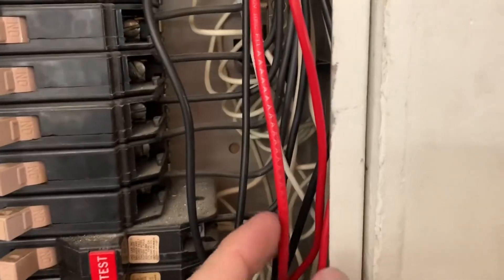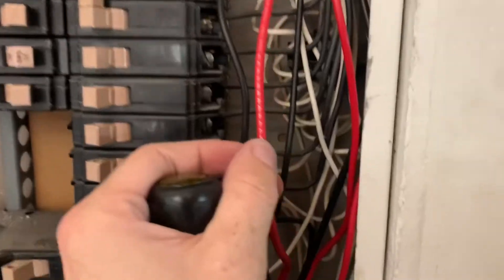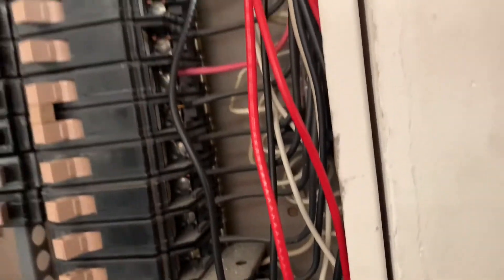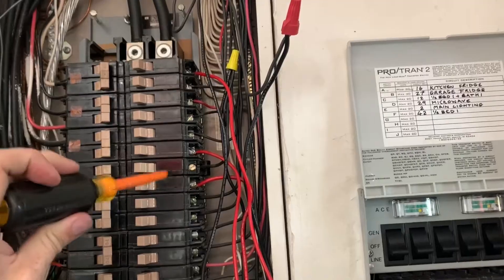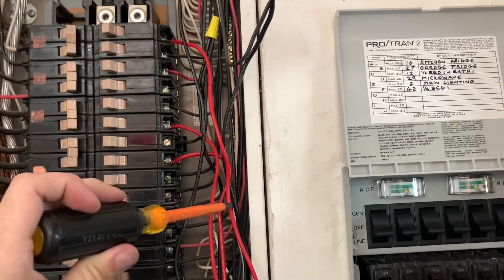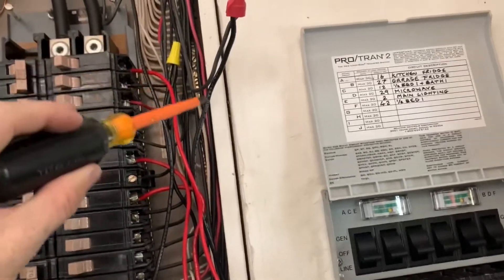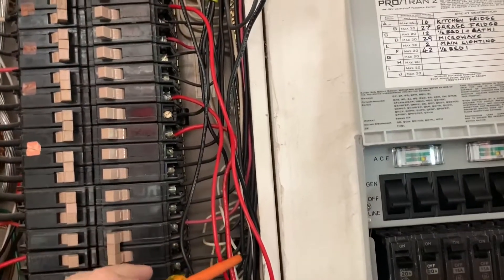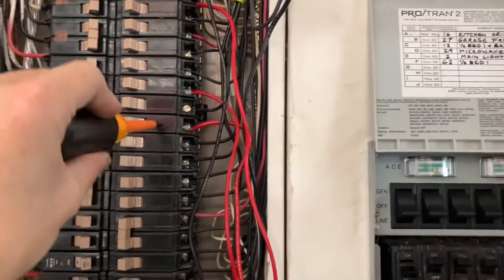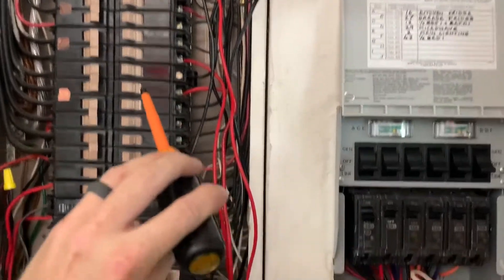Here's an example. This is a red wire right here, marked with all A's. It has a corresponding black wire also marked with all A's, right here. Be careful because these are all live. This wire used to connect into this circuit breaker. We took that off and took the big black and big red wires coming from our transfer switch, running all the way around through here, and inserted that into the connection. So the black wire now connects to the other black wire coming from the fridge, and the red wire from the transfer switch now connects to that circuit breaker for the fridge. We've just inserted the transfer switch in between that black wire and that circuit breaker.